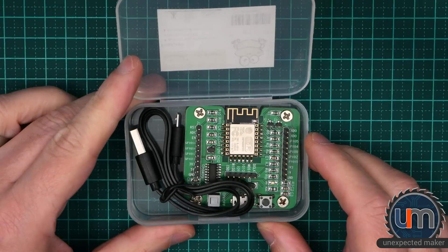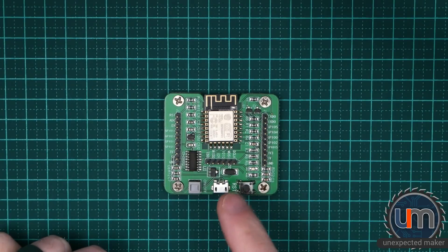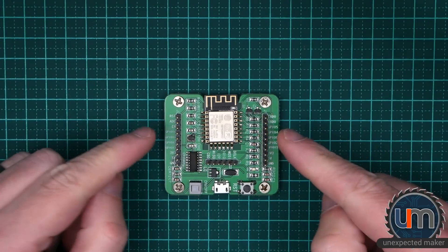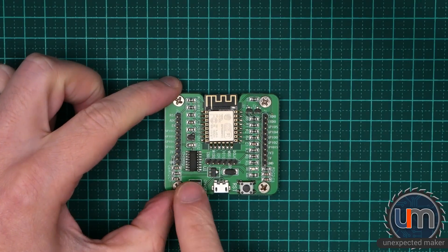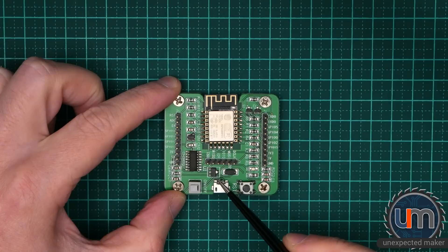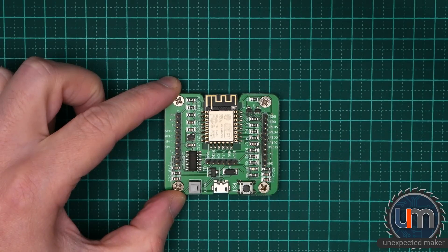We're going to do a rundown of what's inside. We've got a USB cable — it's a micro USB-B — and let's take the board out. As you can see it's got an ESP8266, it's a 12F module. Previous versions of this board were shipping with the E but this has got the F on it. It's got all the GPIOs broken out, and a CH340G UART chip to connect to USB. There's a reset button and a power on/off button — you can leave it plugged in but just turn it off. A whole bunch of passives, a 3.3V linear regulator, and a Schottky diode to prevent power going back. There's a package here with a D120004 designation but I can't find anything on Google about that.